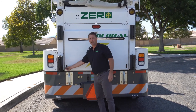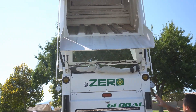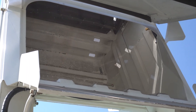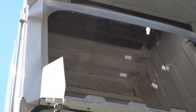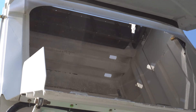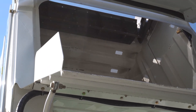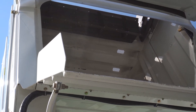With the hopper raised, it gives you a good view. In the hopper, we want to increase the amount of load capacity we can — this hopper will actually hold 5.6 cubic yards of material. Global and all mechanical sweepers build the machine with a hopper load wheel. That hopper load wheel is designed so that anytime the elevator is rotating and feeding that wheel, it will also rotate and load to the rear of the hopper. There's a sensor on the motor that detects rotational speed, and as soon as it detects any interference or slowing RPM, a buzzer goes off in the cab to let the operator know the hopper is full.